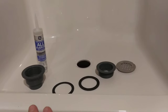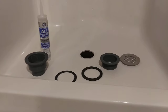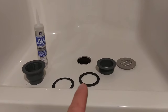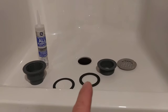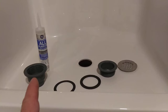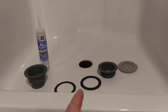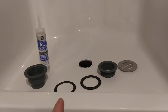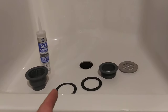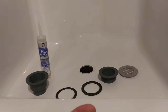The gaskets go on the bottom — never on top. The rubber gasket is designed to seal to the bottom of the tub. The paper gasket is designed to go next to the PVC so that when you tighten it, it doesn't bite in and bunch up the rubber gasket. The paper gasket is basically a material that significantly reduces friction so that you can turn it and get a good seal.